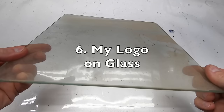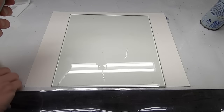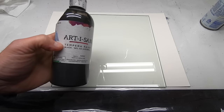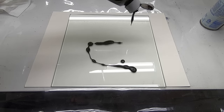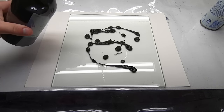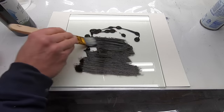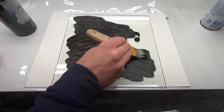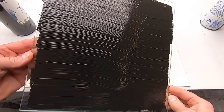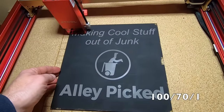The laser can easily score and engrave images on glass. I found this piece of glass in the alley trash — it was a shelf inside of a cabinet that somebody was throwing away. In order for the laser to engrave it, the glass needs to be cleaned thoroughly and then obscured. For that, I'm going to use some cheap black tempera paint — just a couple of bucks at the hobby store. I found that a soft bristle brush works the best; I didn't have good luck using a foam brush. You might need to give it a second coat — you can't have any light showing through the glass. After engraving, you simply wash off the paint and any residue on the back.